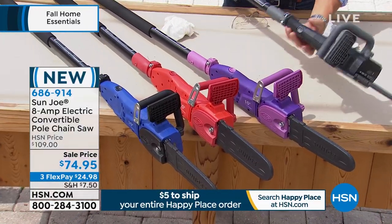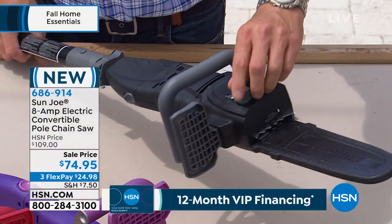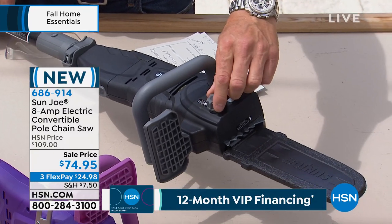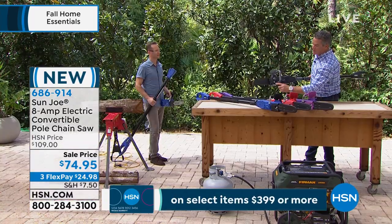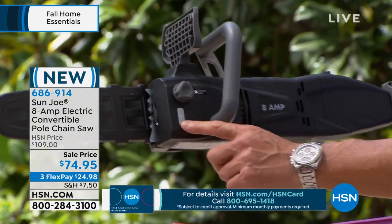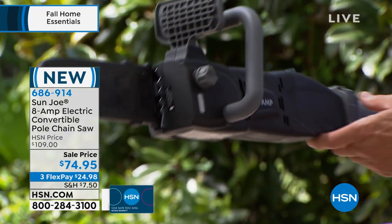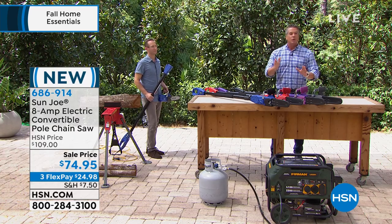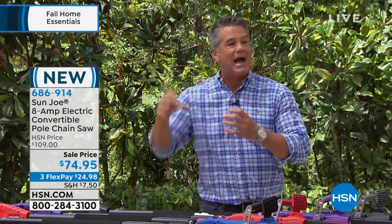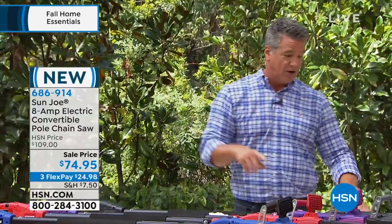You're going to notice there is a little tiny valve on the black. Here it is in black. That's your little bar and chain oil valve. When you go to the home store, you'll see a little bottle — it'll say chainsaw bar and chain oil. You open this up, put a few drops in. You see a little window — the reason you put that in there is because this chain needs to be lubricated as it goes through all the gears inside. This very slowly trickle-feeds the chain so that your chain runs smoothly. That's what can go wrong with most chainsaws — they get locked up, dry out, rust. When that oil goes in, it automatically oils it, and you've got a smooth running chain.